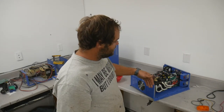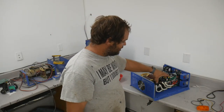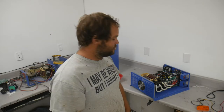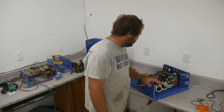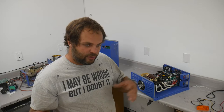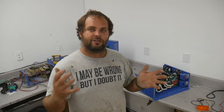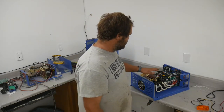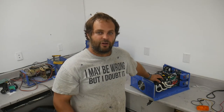You can take all these diodes that you turn off and on and rectify that low voltage AC back to your charger. And if you've got a little charge controller like this has built in somewhere on this board, that allows you to control your voltages and turn the MOSFETs off and on at a certain part of the sine wave or something, to control your battery charge, you know, very precisely.